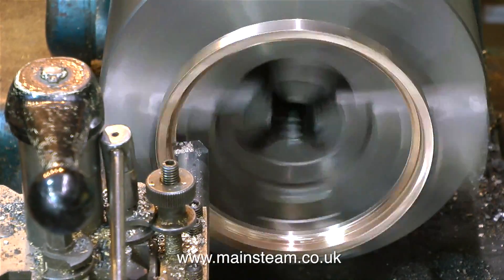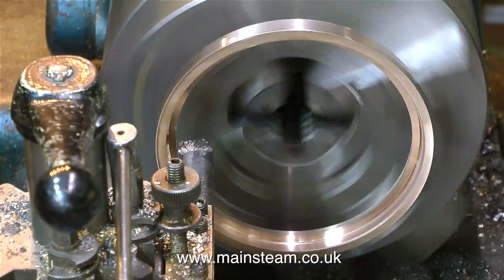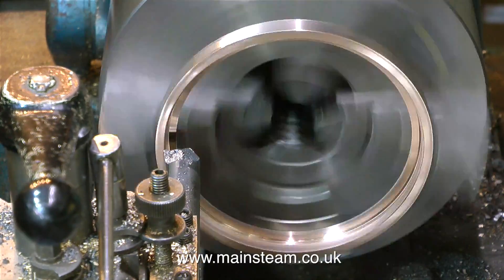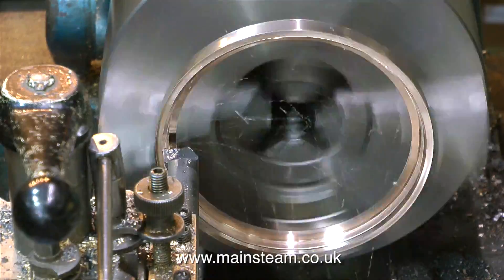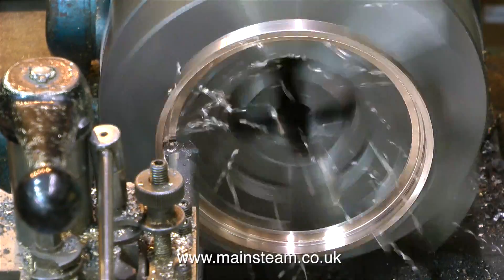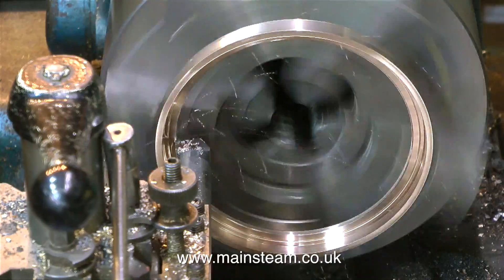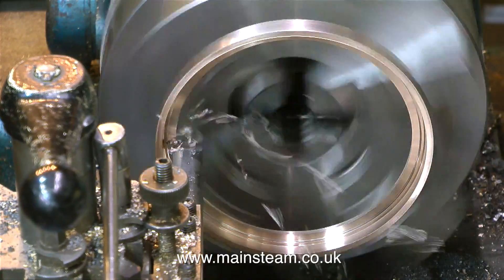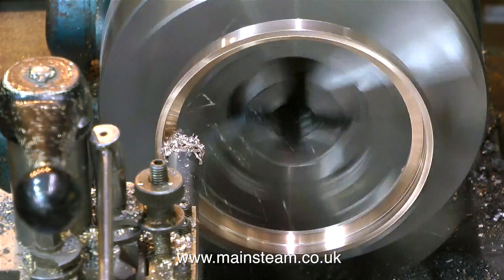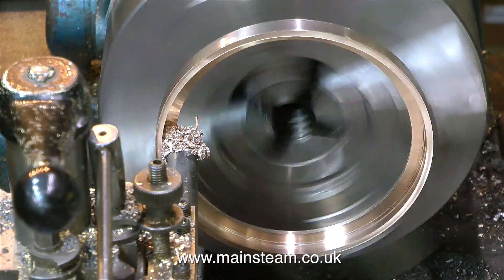As mentioned in the first episode, this gunmetal casting is really a smoke box door ring designed to be part of a five-inch gauge locomotive called a Sweet Pea, and once again I'm using my boring tool to machine this component. Gunmetal can be difficult to machine — it's a very strange, slippery kind of metal. It's not like brass and doesn't machine anything like brass, and it's certainly better for wearing as bearing material than brass is. The chips come off and fly everywhere, and to successfully machine gunmetal you need a sharp cutting tool and the correct speed and feed.